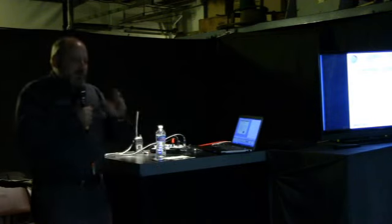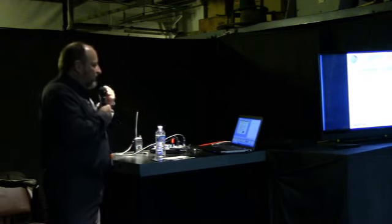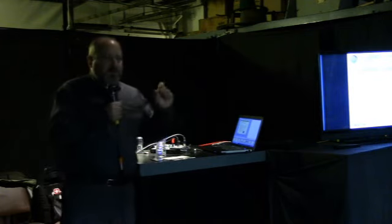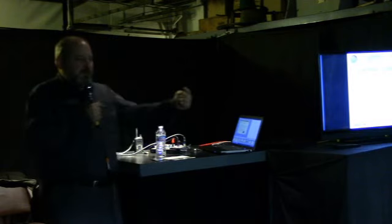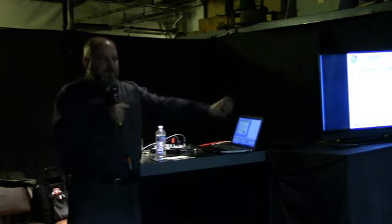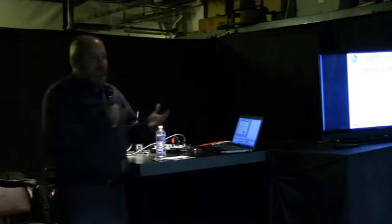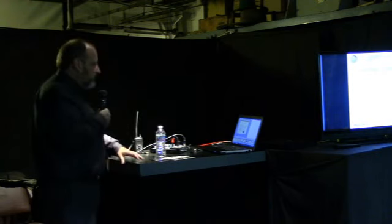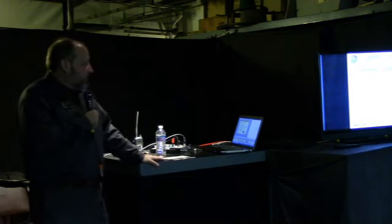So the voice is converted from analog to digital by this codec. So you have a digital data stream that's 2400 baud for voice, and then there's 1200 baud of forward error correction attached to that, and then there's still 1200 baud left over for data. So it's a 4800 baud signal that's being transmitted when you key up the radio. So that data might be empty. The data part is largely empty in most cases, but it does exist. And then, of course, you can go up to 128 kbaud on the 1.2 in the DD mode.